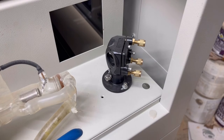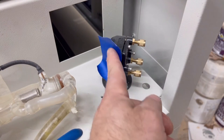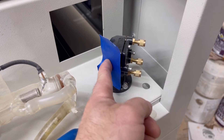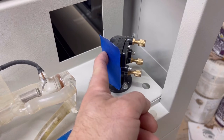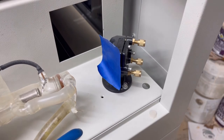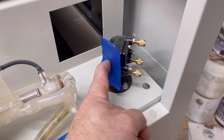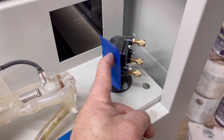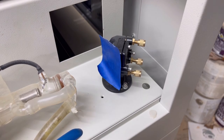Okay, here we are up close at the first mirror. I'd like you to get a piece of painter's tape and put it right over the mirror, then press around the outer ring so that it makes an impression and you can see the actual circle. The reason we're going to do that is because when we fire a pulse and it burns into the tape, it's going to give you a reference to see how close to center the laser is hitting. Make a good impression so you can see the circle, and then we're going to fire it up.